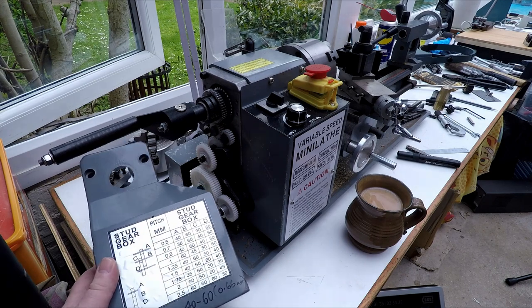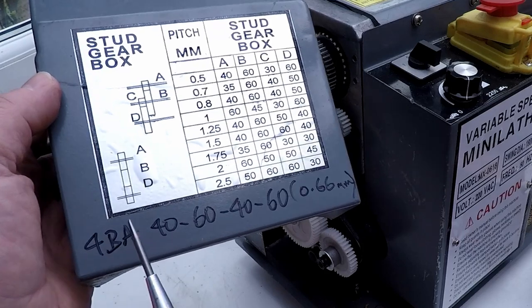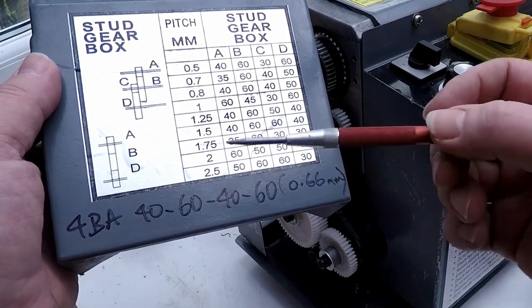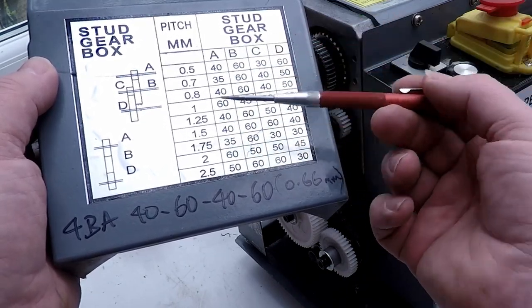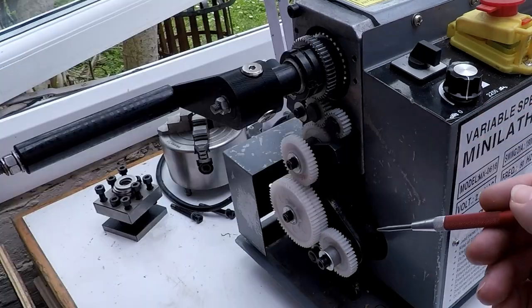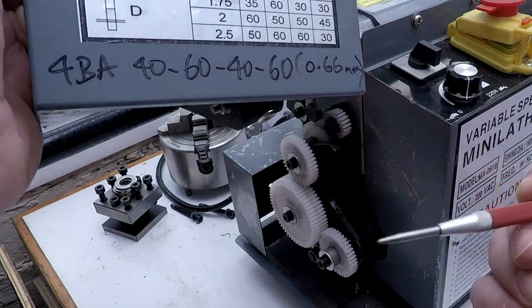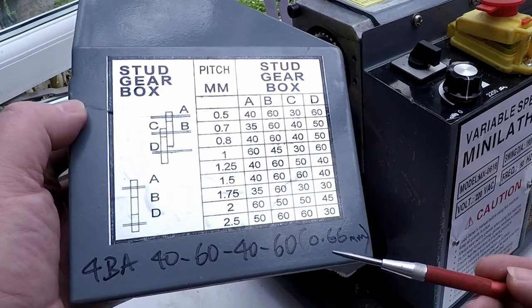And you might notice on here as well, if I show you down here, I've got some scribble on here. The other day I had to cut a 4BA thread, which has an unusual pitch. Well, for metric anyway, which is not listed on the list here. So what I did was there's a really useful website you can go to, and I'll put a link in the description so you can go and have a look yourself. Basically pump in all the various gears that you have into this calculator. So you list all the gear wheels that you own, tell it what pitch you're trying to achieve, and then it'll give you various combinations of gears that will actually give you that pitch.